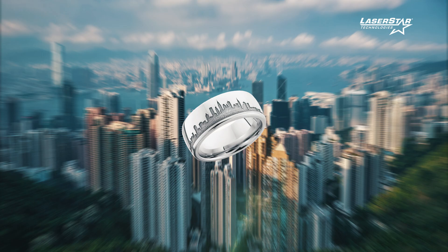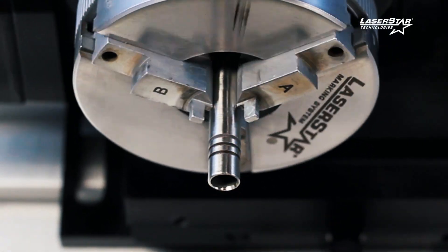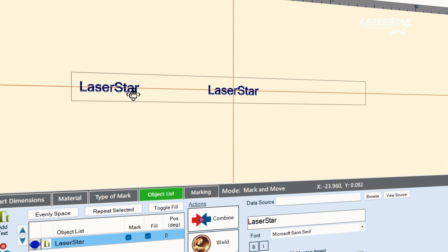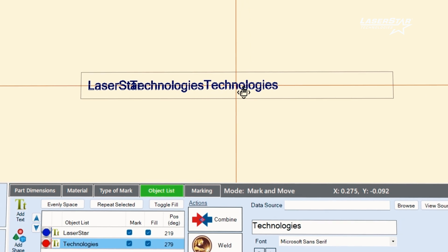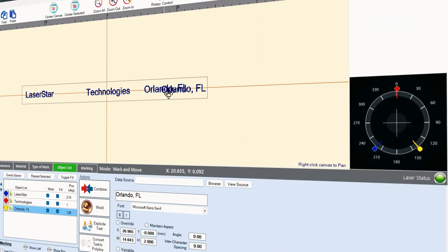No start and stop. There's no overlap and it brings the artwork together very nicely. In order to get very good consistency, we have push pins that show where text or an image is located within 360 degrees. So if I want something symmetrical on each side of the ring, I know exactly from the push pins that it can be 90 degrees and 90 degrees, and that way when I look inside the ring when it's done, it's very well centered and clean looking.